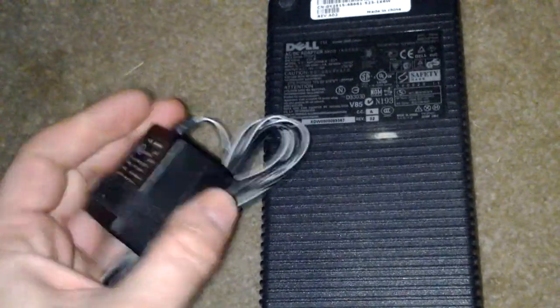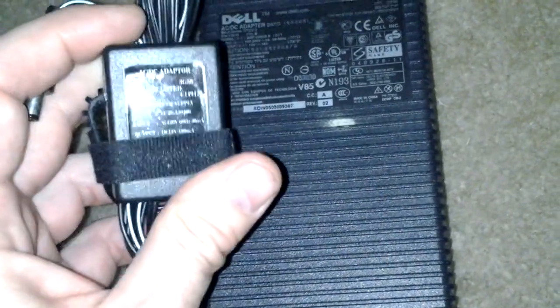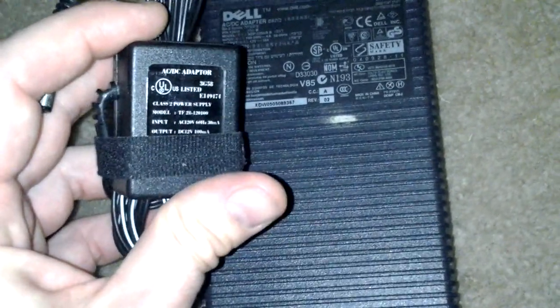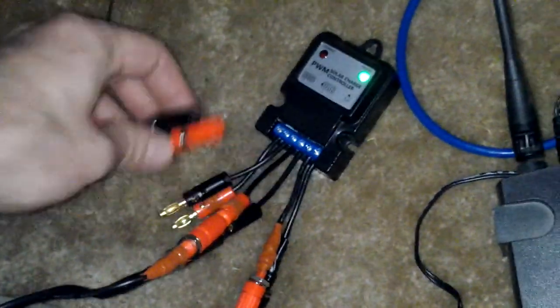How do you get a hold of a 12 volt 2 amp power supply? My answer is yard sale, just any kind of used stuff you have hanging around. This one's a 12 volt 100 milliamps, so it's a tiny one. Here's an 18 amp charger — this would be kind of way overkill. It would probably work, but if you run the battery down too far and power finally kicks on, it's going to charge this battery possibly too fast and could cause a little damage.